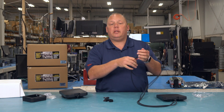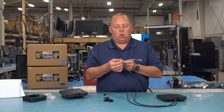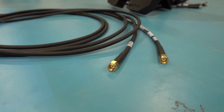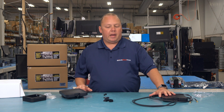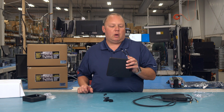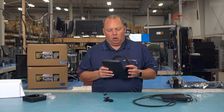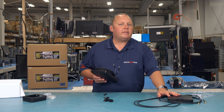The Falcon comes in two flavors currently from a cable perspective. The one I'm holding here has SMA cables — they look like very small cable TV connectors with a small center pin in the middle. This is the connector for the cellular side of PepLink devices, just about all of the mobile routers we sell. The only exception would be the MBX line, which is our enterprise line and uses a QMA connector — though we do have adapters for that. The second type you can get is called a TS9 connector, which is popular in mobile hotspots — the Verizon 8800, the Netgear Nighthawk, and pretty much all versions of those will use that TS9 connector.